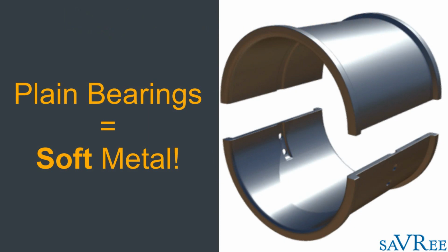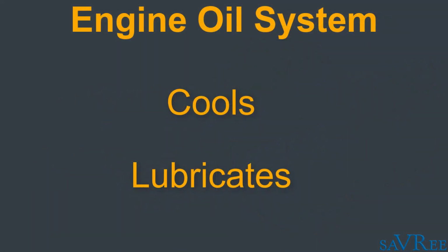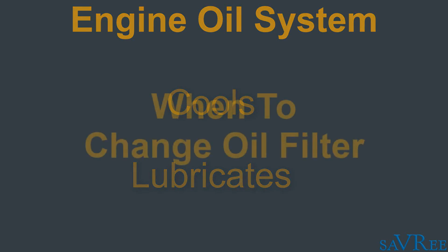So our sandy particles, if they get in there, they're going to scratch away at the bearing, and then we might end up with bearing hotspots, or we might just end up with a thinner bearing over time. And this might cause lubrication issues. So there's a lot of things that could occur if we start eroding away some of the engine components. So the oil system is absolutely critical to the engine. It cools the engine and it lubricates the engine. If we start having a very dirty oil system, then we're going to start getting a lot of problems.